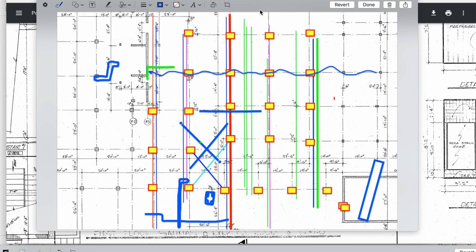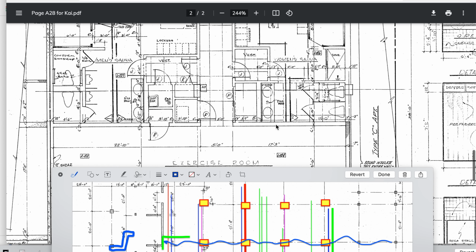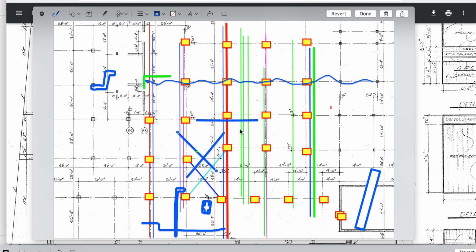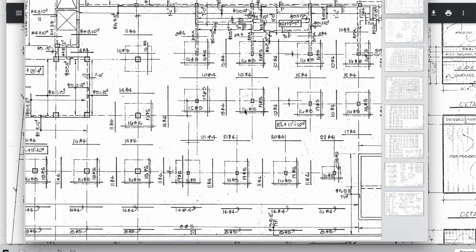to pull on it, however, in that direction that the steel is placed. Now, talking about main bars and transfer bars, if you will, which transfer the load to the main bars, let's think of it like that. Well, our steel is 16.5s and 19.5s, and then we come out there at 12.4s, and this direction is 10.4s. Okay. So our spans are about equal, but now they've changed it to 10.4s. So these fours come across, and they meet very close into this critical shear area, but at one point they go out, and they miss it altogether, and they're outside of it, this direction.